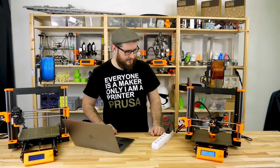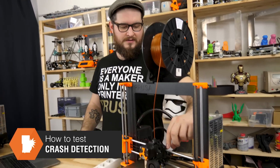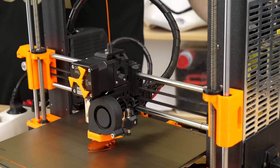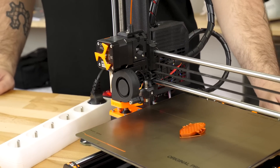And we successfully recovered. Next test is the crash detection. Always just pinch the rods and wait for the extruder to crash into your fingers. As we can see, it successfully detected the crash and it rehomes and continues.